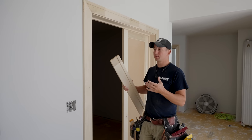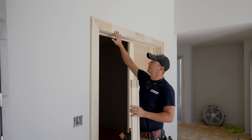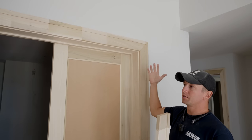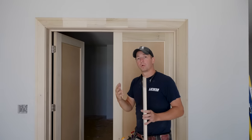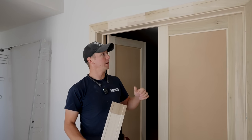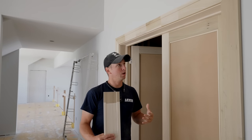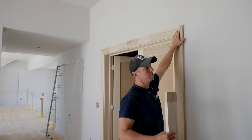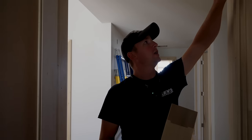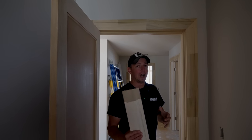In this house it's a completely different story — the humidity is controlled, the air conditioning is on, which naturally dehumidifies. That ensures that whenever we install this millwork it'll have the best chance possible of holding up for the long haul. We're upstairs here and everything is coming together nicely with really nice miters. We're fighting a battle on two fronts: keeping the builder on our side so the space stays conditioned, and making sure these miter joints hold up.